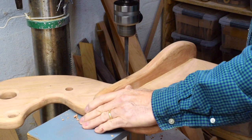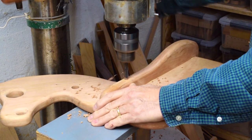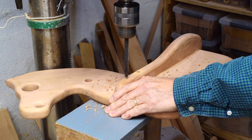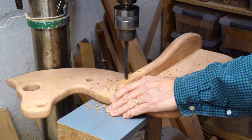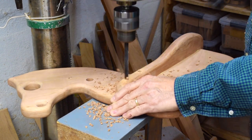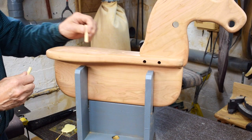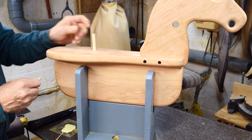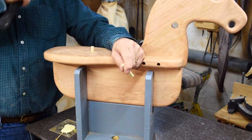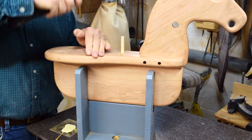Most of my dowel holes are drilled or bored with regular twist bits, as in the letter size I described earlier. I do regrind the tips, and you can see how I do that in another YouTube video on my channel. The black thing I'm using is just a jig I made since I make so many of these horses. It helps to make it, but it's not absolutely necessary for a one-off horse.